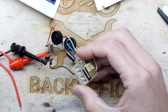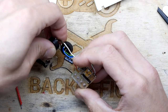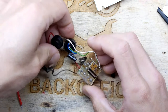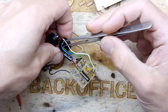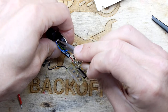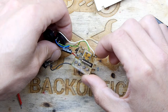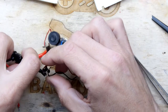I'm going to turn that on. Nothing — but then I say nothing, I think you're supposed to push the buttons to make the actual screen come on. No joy at all. So I think this is the button that was on the front. If we just short that out — press the illuminate button — you'd hope to see something appear on the screen, but yeah we're not getting anything. I think it could be a case — I'm looking at the current draw and it's absolutely nothing.